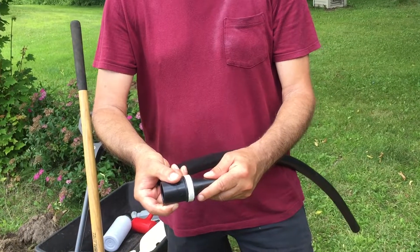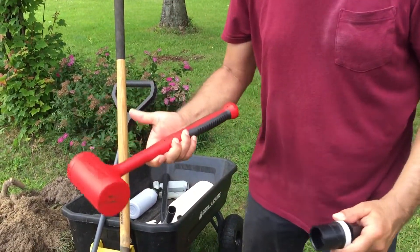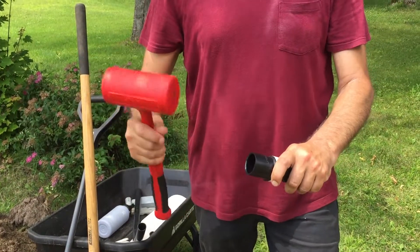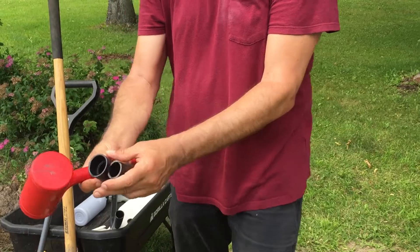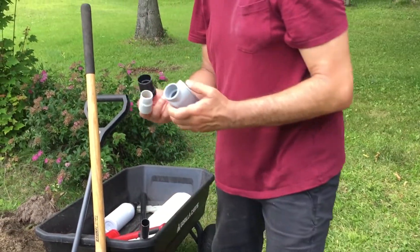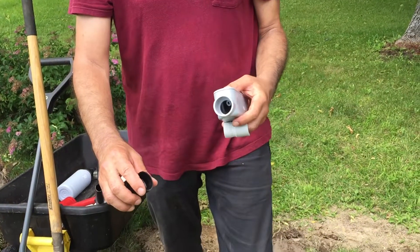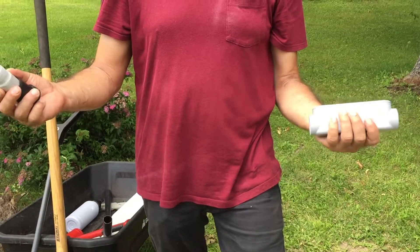One thing to note: the 200 PSI pipe goes on with a real bite. To seat the blue lock fitting on the 200 PSI, I used my 56-ounce dead blow hammer. Once I got it lined up and pushed in enough to twist and stay on, I really gave it to drive it all the way down until it hit the lip. For connecting at the ends of the poly pipe, you can use stub two-inch pieces, glue them together, and that makes it a lot less expensive — no need to glue every 10 feet on a 200-foot run.